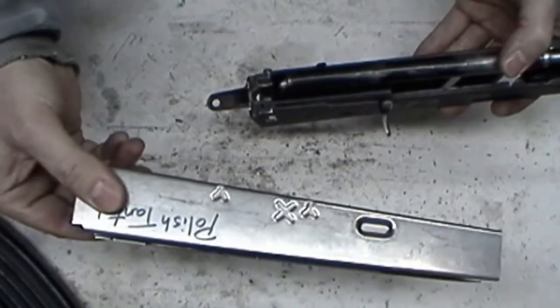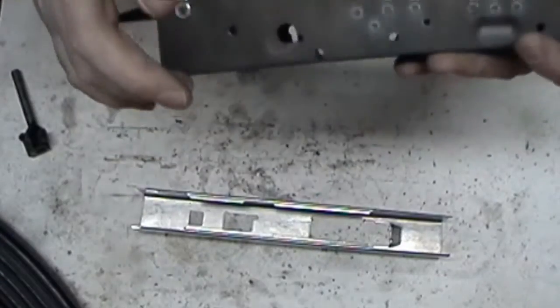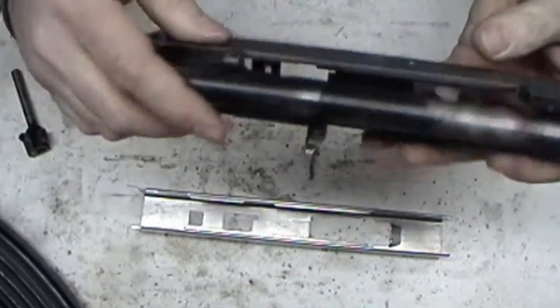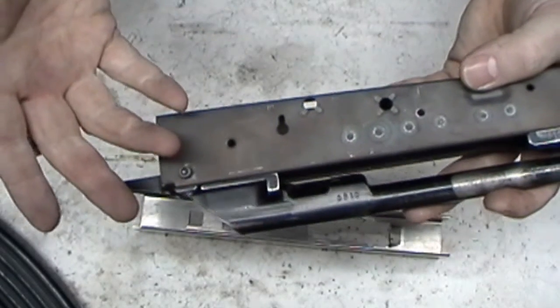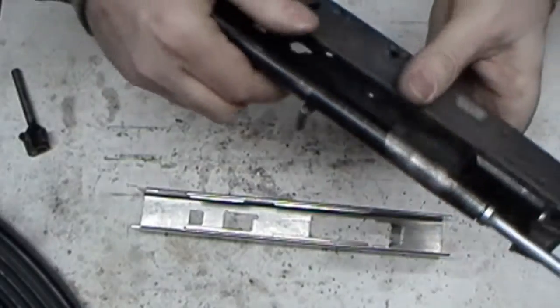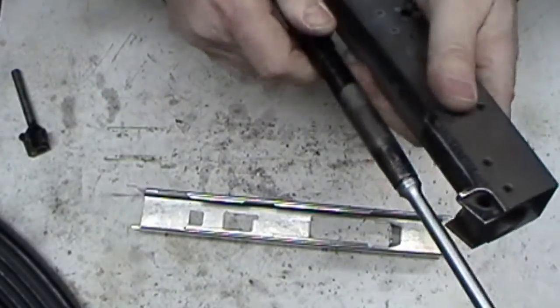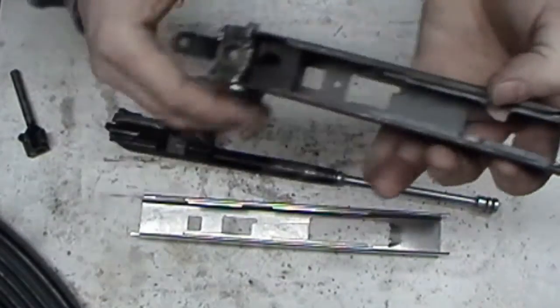It does well with oil quench with all the right times and temps that I've been using. And this flat that I did from AK Builder, which worked, it was successful. It worked with water quenching, same times and temps. But normally I have to trim the rails. Now that I got that in there, I won't be able to get it out. Oh, there it goes.